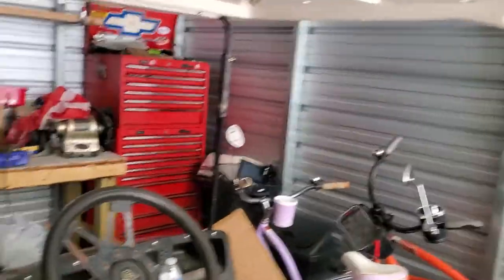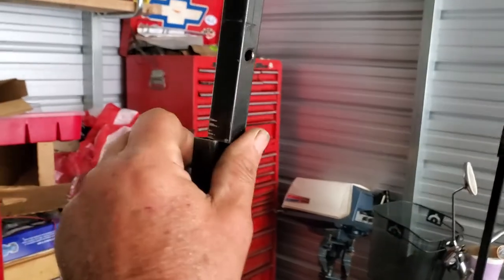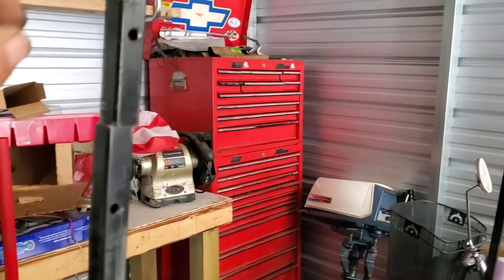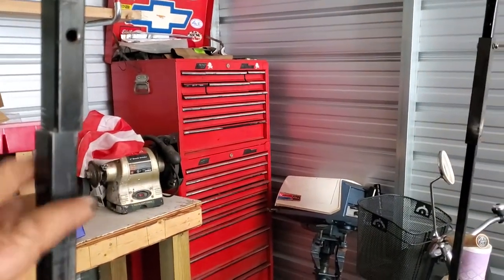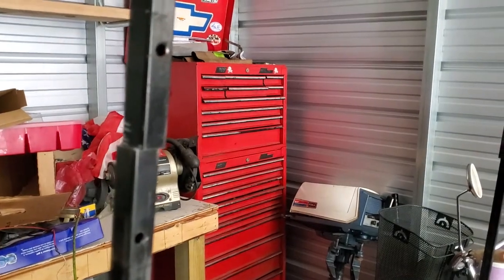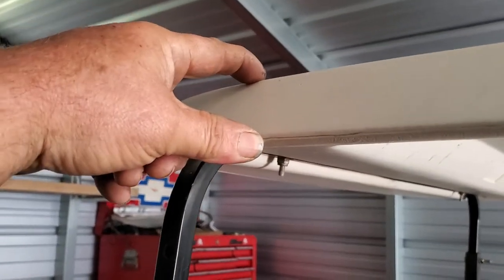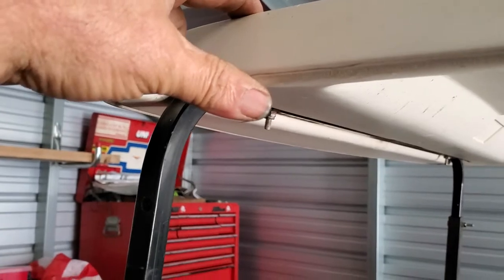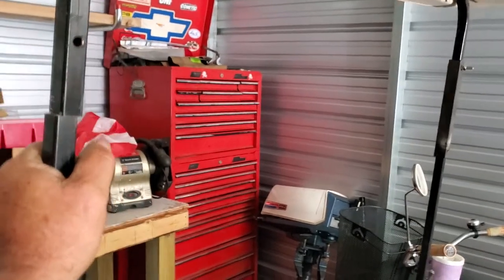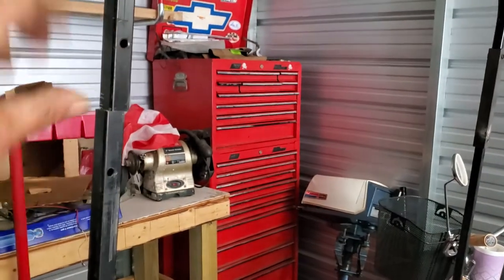So what I did — let me get up here, got a part of the mess in the shop, we're doing a little renovating — is we took a tube and we cut it. We measured how low we wanted to go and we cut that much out of this tube. In our case, we needed to go down about two inches because the top was about this much too tall, being as our cart was lifted. I thought about it and thought about it, and I came up with this solution of a pin where we could telescope the top down.